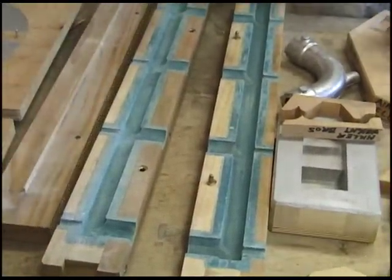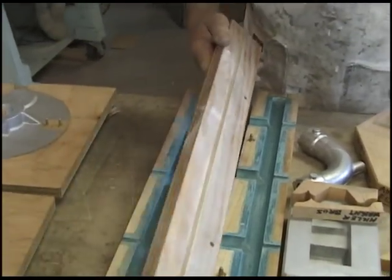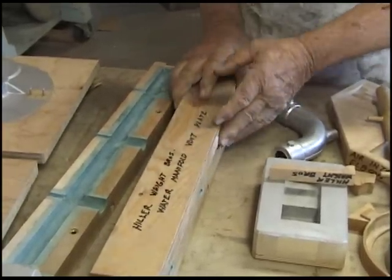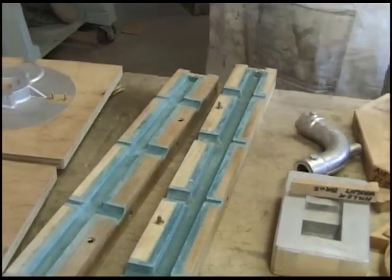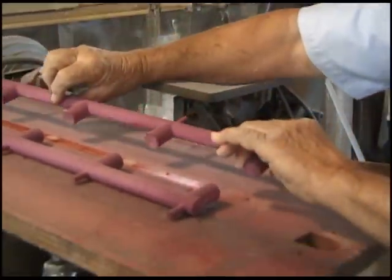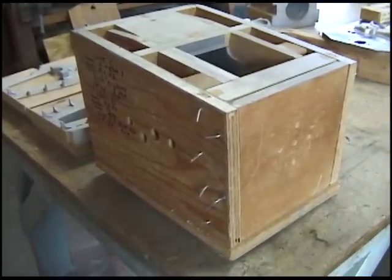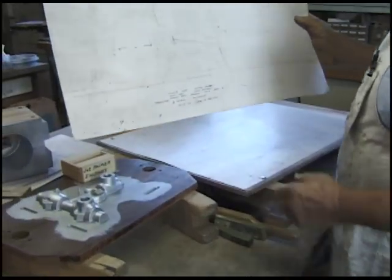So that's poured. We poured plastic to get that. And then this is a vent strip. Before we put that core together, after we filled it with sand, we put this piece down there in order to have a hollow channel to let the gases out. And here are the cores that are made over here. That's the sand core. This is the core box for the cylinders. Back to the layout again.